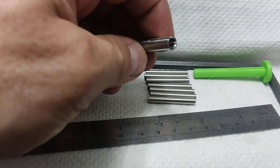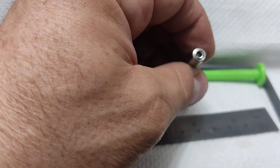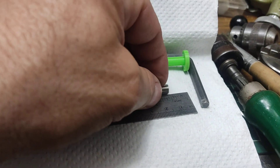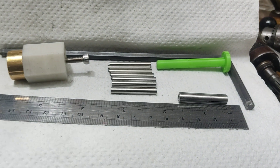If I have no other choice, I've made this one from stainless steel — it has a nice stop there as well — and I'll just machine them one by one with an indicator to see where I need to stop.